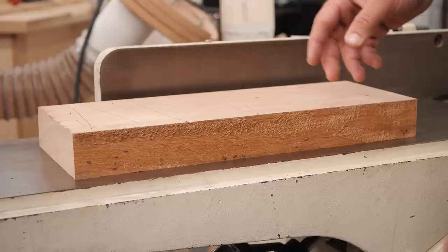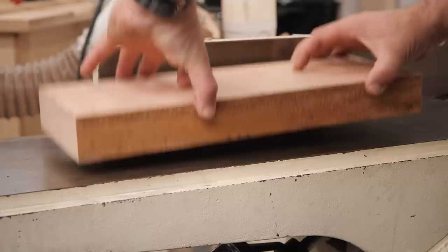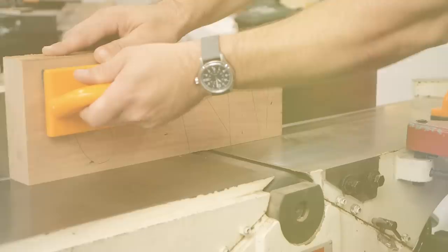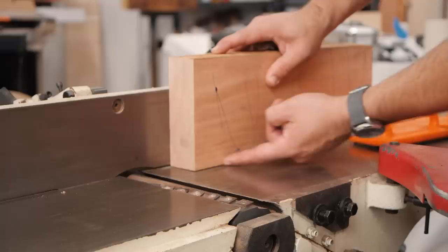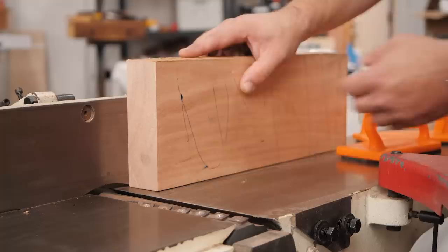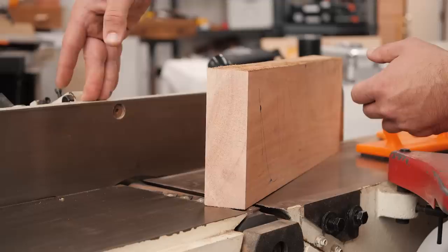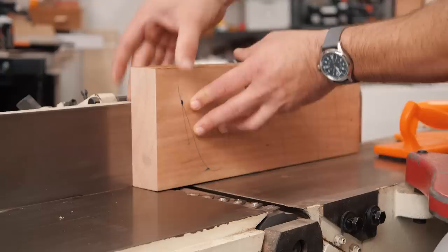As you can see, there's no sunlight coming through, there's no more twist, and when I pick it up there's a slight suctioning effect. So we have both sides flat. Obviously this is not how you would flatten a board — you would do one side, then run it through the planer. But once we have a side flat, we're going to do the edge. You want to make sure that you're pressing against the fence — you can see there's a huge gap here, so we know that pressure needs to be against the fence, otherwise we're not going to get a square edge. As soon as you get to the outfeed side, you want to push down on the outfeed side. One way I've found to be a lot safer is I keep my fingers on the top of the fence — I know that even if I were to slip, I can catch myself. So I always keep my fingers on the top of the fence while I'm pushing down, and that allows me to feel a lot safer.